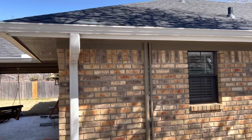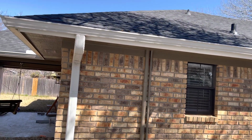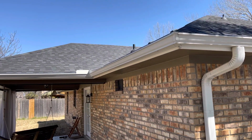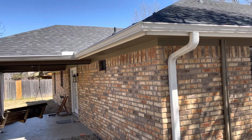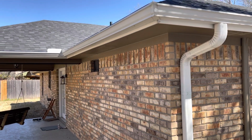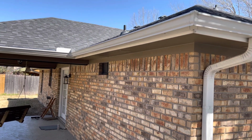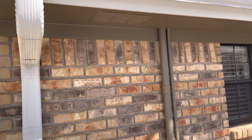So after that, I went from the SE cable to direct bury underground cable. I don't think it can be loose up in the attic, so I put it in 2-inch conduit. You can put it in a little bit smaller, but I didn't want to wrestle with it too much because that wire is kind of thick and hard to wrangle. So halfway through the porch here, there's 2-inch pipe up there laying on top of the rafters. And then we come up here and it comes out right here.